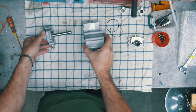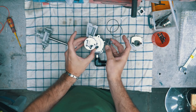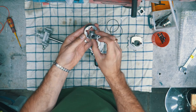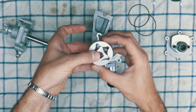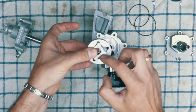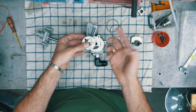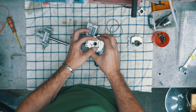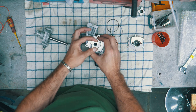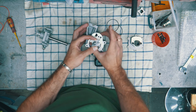Inside the pump you have what is effectively like a rotary engine — that's how it works. That inner rotor rotates inside, and every time it captures a bit more oil it pushes it through and around, creating pressure. The inner rotor is on a shaft so it doesn't wobble — it's the outer ring that goes around its location.